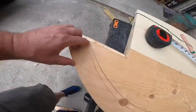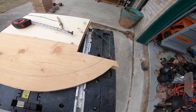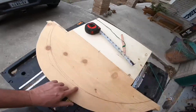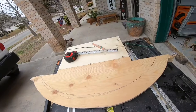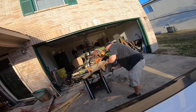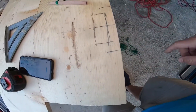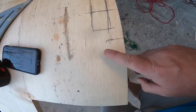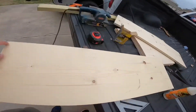Everything's cleaned up and centered, nice and flat. I'm following a line and this second line came out a little smoother than the first. For the handle, I have about an inch on each side, and it angles down about four inches so your hand fits comfortably. I'm going on the outside of the board instead of the inside — that's easier. I'll go ahead and drill a couple of holes for wood screws.